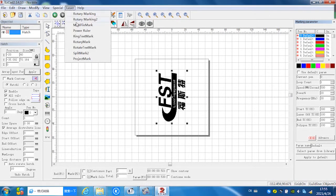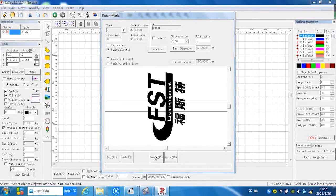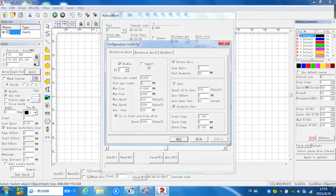Next, click the Laser button at the top of the screen and click Rotary Mark. You can see the dialog. Select Enable. We don't select Invert because we are using the Y-axis. Place the rotary on the right side of the working table and select Y-axis. Set the pulse to 5800. Under Rotate Axis, input 99 millimeters, because we have calibrated this cylinder diameter to be 99 millimeters. Input 99 millimeters and confirm it.